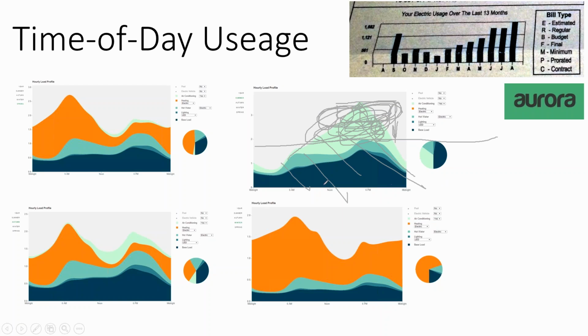Whereas if you don't have net metering and you're producing an array that does all of your energy, well, a lot of that's going to be outflow in the middle of the day. And if that's compensated at avoided cost, you're not going to get good value out of it. So the one frustrating thing about solar is that the value of solar is higher than retail if it's designed with all of its total functionality. It's just that the billing structures are not in place to uncap that value.